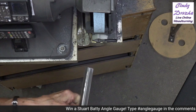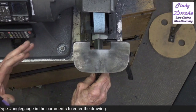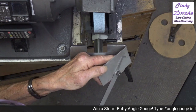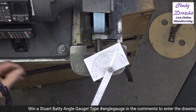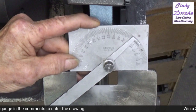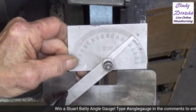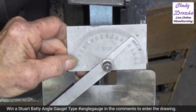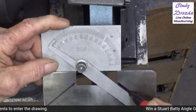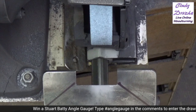This is just for demo purposes — I do not sharpen with a 46-grit 3X wheel on a daily basis. What I'm going to do first is set this up for platform grinding. I'll take my protractor and put it across the top of the platform, which is intended to be parallel with the edge of the wheel, and make a line. Then I'll go over to the other side — 40 degrees — and make a line on the other side. Those lines are for platform grinding of a 40-40, and that is how I get the sweep angle.